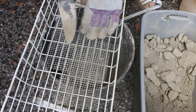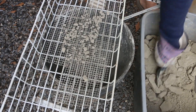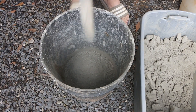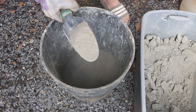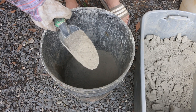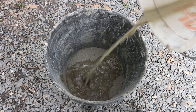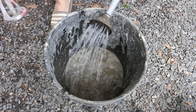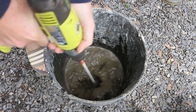It would be better if I had one piece big enough for the job, but it's what I've got. Not a hundred percent powder, but better than if I hadn't done this. I'm going to try and mix up about twice as much as I have been — I want to see if I can get this pour done in one batch. In case I have more than I think I do, I'm going to have a form on hand to pour the extra aircrete into.